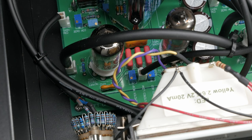Limiter response calibration at RV137 and RV237 is really a matter of taste. This controls the amount of high frequency compression. With the trim pot all the way clockwise, you get a flat sidechain response. Turning it counterclockwise will result in compression which is increasingly more sensitive to higher frequencies. Play around with this using some source material until you find a spot you like.